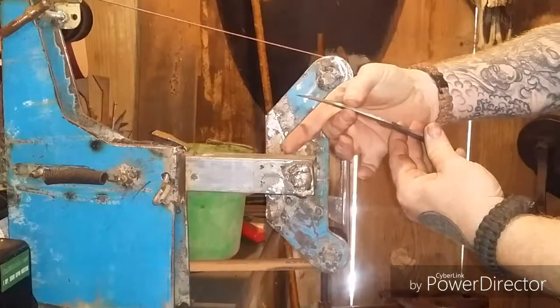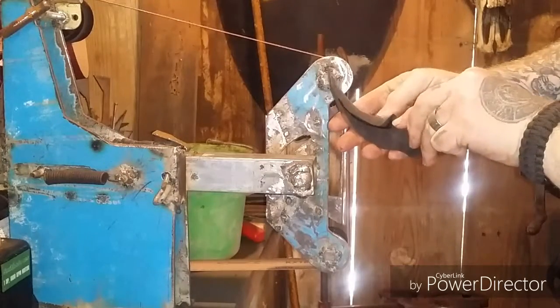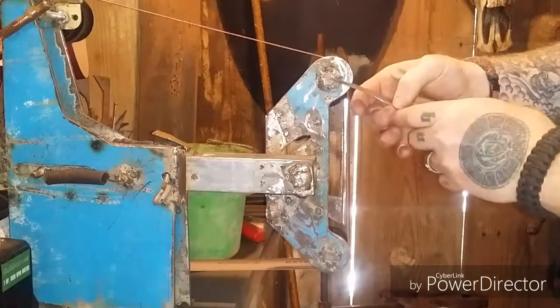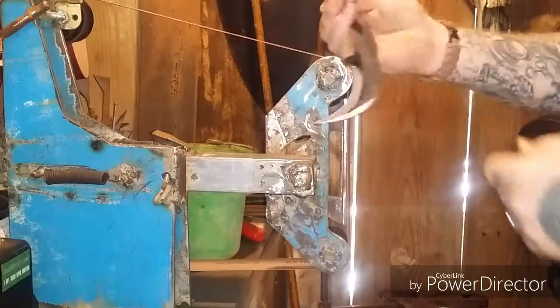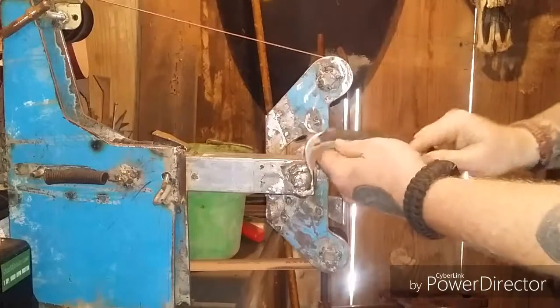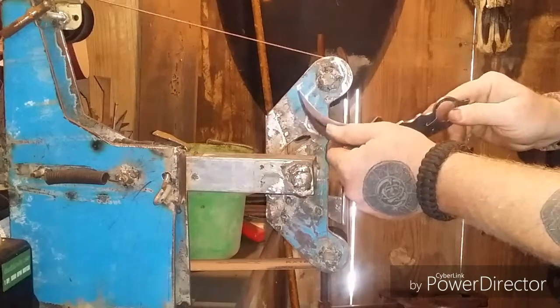Gives me a slight distal taper with a little bit beefier on the flats. I've got probably a little bit less than a dime thickness left on that bevel, which should be plenty good for me to harden it. I've actually got the finger holes and all in pretty good. I'm happy with how that's looking, and go ahead and move to hardening and tempering.